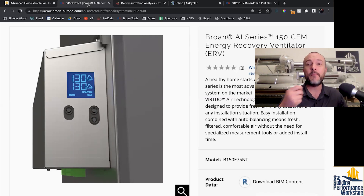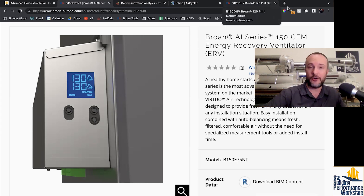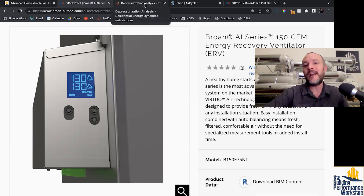So here is how we're doing this in modern ventilation. The two airstreams — incoming airstream from outside and outgoing stale air — are run by two different fans. We now have access to what's called EC motors, which means they're infinitely variable. You can turn a knob and it'll slow the fan down or speed it up. So we can now, on several brands including this Broan right here, turn the incoming airstream to a different number than the outgoing airstream. This particular ERV blows 150 CFM total.